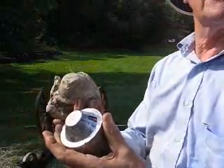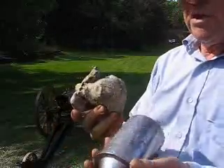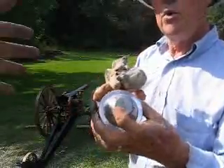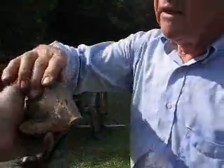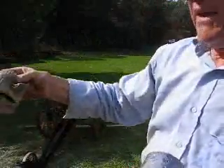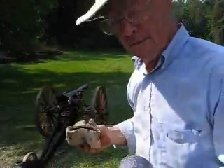We're going to try it one more time and see if our luck holds out. The problem we had before was that sometimes, because these were hollow, the top was kind of weak and occasionally the top would fly off and leave the skirt of the projectile in the barrel. That's what happened to that cannon in the back of the truck, and that's why we're firing this cannon. More later.